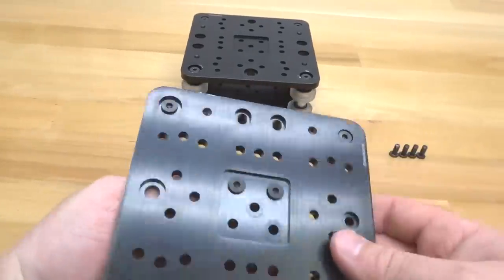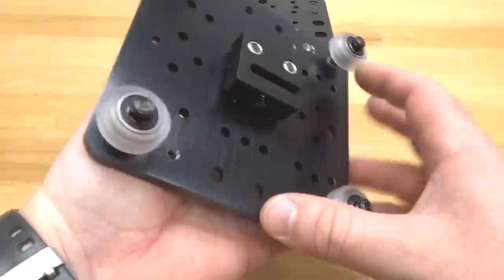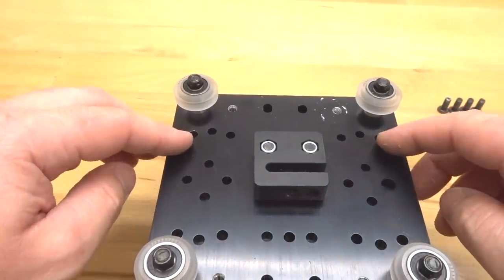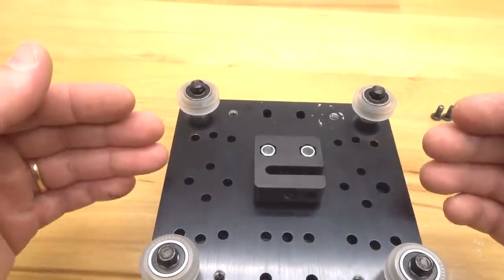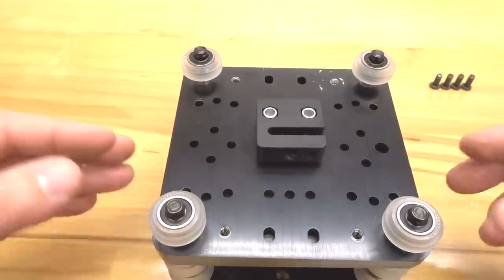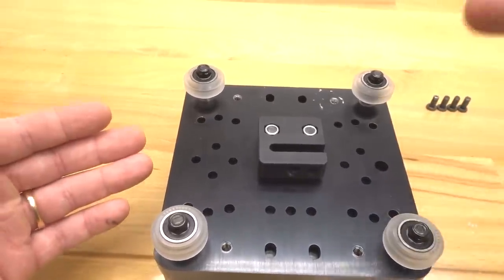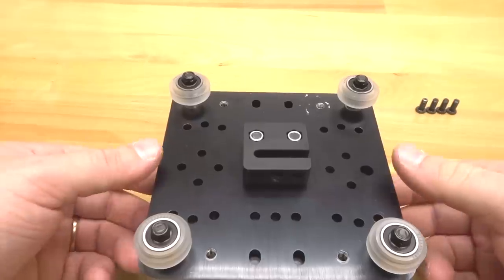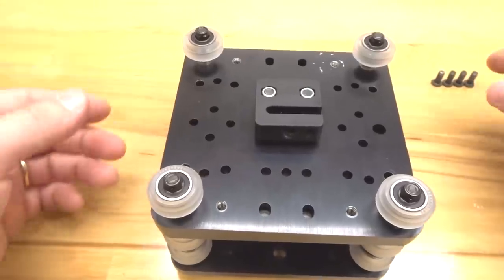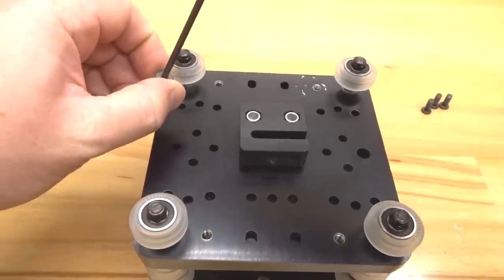All right, that's perfect. So now we're gonna flip this plate on top of our X carriage assembly, taking notice to our design and our extra large plate accompanying this mating process. So we have two holes here and down here that have threads. So basically all we have to do is screw in our 12 millimeter screws and the bond is strong between the Z and the X carriage. So let's go ahead and put those screws in now and let's tighten this down.